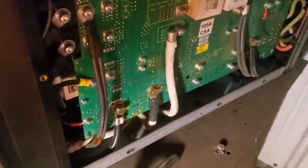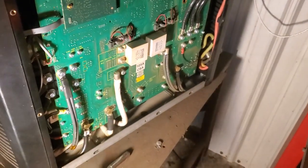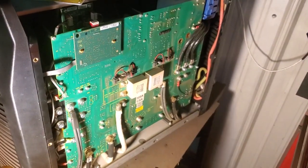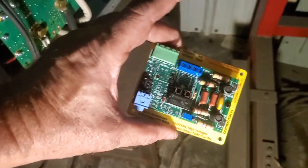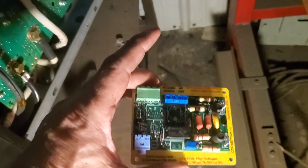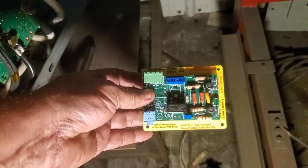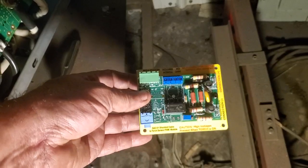And it's kind of a common occurrence that the onboard divider will go out. I've seen Tom post that it's a capacitor that goes out. I don't know. I know that you can get them repaired, but they're expensive to repair. And so what happens is Tom at CNC makes this RAV-02 card, and this RAV-02 card will install inside of pretty much any compatible plasma unit, and it will give you all of the things you need to make it automated. And one of the things it gives you is torch volts, right?